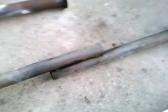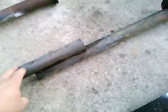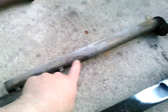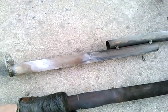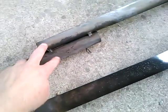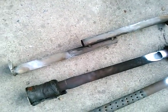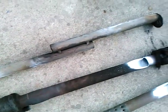But I wanted to try something with a reverse flow. I found this one and a half inch diameter antenna mast — and I hope I don't regret someday sacrificing it for this project. The exhaust is forced inside the one and a half inch diameter pipe, then it has to turn around and get into this outer pipe to get out. This was a pleasant sound and the most quiet of all these designs. It was pretty difficult to build — it has to be well aligned for everything to slide inside the pipe, and these had to be squeezed down and welded together to fit inside the three inch pipe. Since the in and out on this is one and a half inch, plus the reversion, it's probably the most restrictive, but I don't have any exact measurement of that.